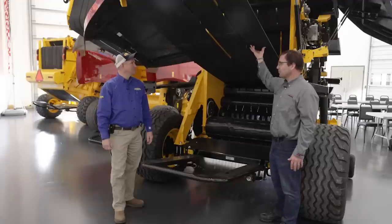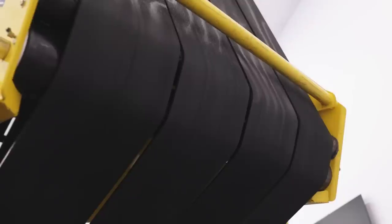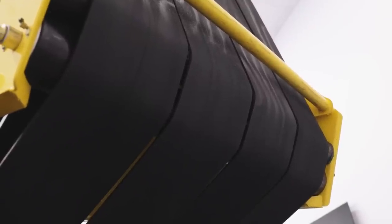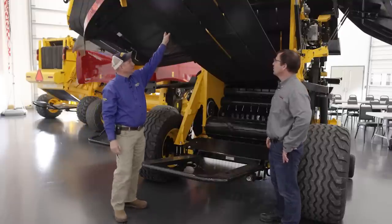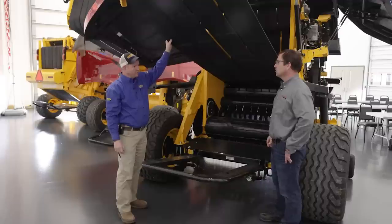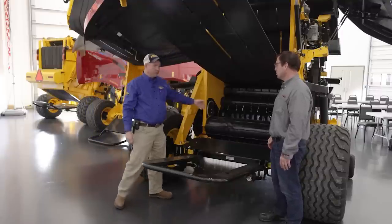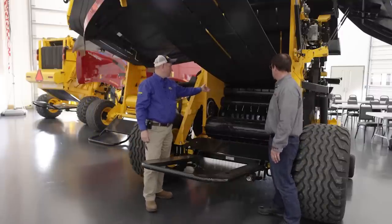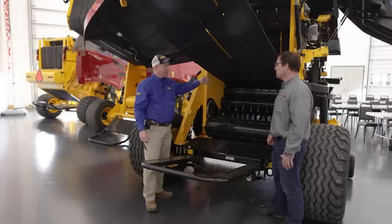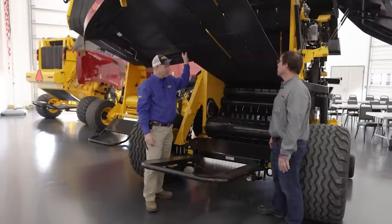One thing I guarantee is the belts — they're completely different from what we have on our other balers. These are wider, 11-inch wider belts, and we have four of them. The reason is belt stability — there's less chance of twisting this belt during operation than with a narrower belt. You can't flip it over. They're also a thicker belt — heavy, thick belts. We are still turning the bale with a floor roll, and we still have the starter roll and stationary roll, so we're still turning the bale with three different systems, taking wear and tear off the belts.